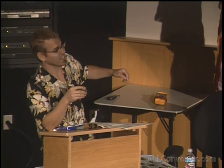And so you can run a Tesla coil directly from 480, connect it to a condenser, spark gap, and coil, and run it that way. It's very hard to quench the gap. With this type of system, you can throw the self-induction coil in, and that'll help limit the current through that system. And because there's contacts there already, it'll automatically set the gap for you.